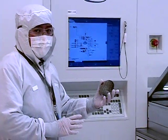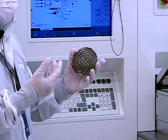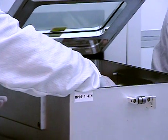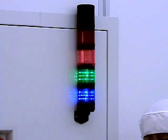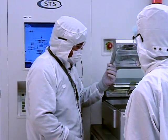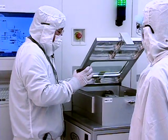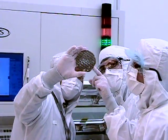Here I have a wafer — silicon bonded to glass — and I'm going to load this into the tool and it will etch the pattern for our devices. Now we're unloading the wafer out of the chamber; it's already finished etching. Because it's been etched through and it's on glass, certain features are going to be transparent — you should be able to see right through the wafer.